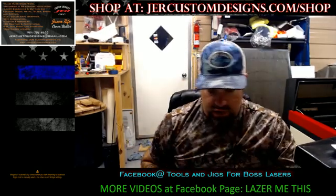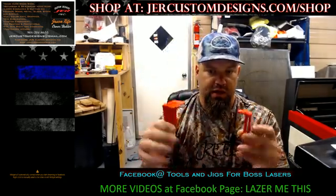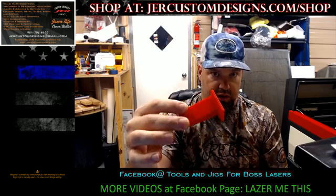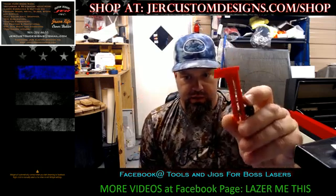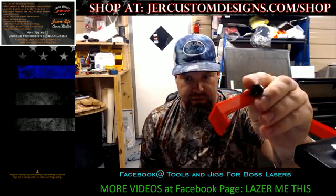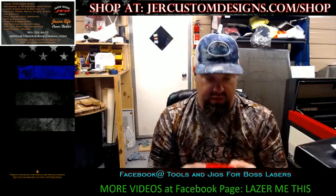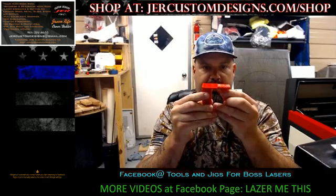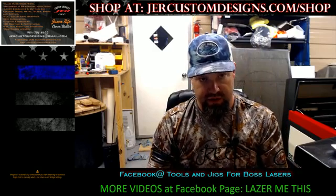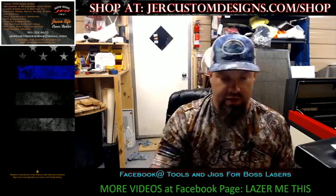All right, so the other thing is the hold down clamps themselves. Here's the old one here. You can see how big it is. And then here's the new one. The profile is a lot slimmer. The head is a little bit skinnier, not by much, maybe not even at all. But nonetheless, those are 4.2 millimeters thick, so they'll sit 4.2 millimeters above your bed or your material that you're clamping down.